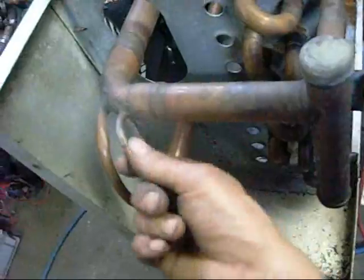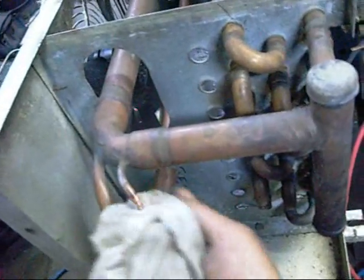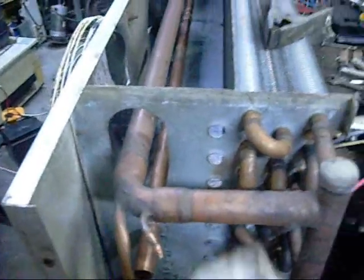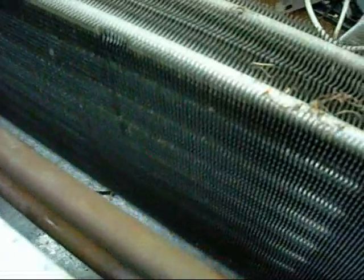That's already absorbed most of the humidity around here. The thing about this flux is it's boric acid flux - as soon as it absorbs humidity it turns to water, like a liquid boric acid solution, and it always goes green and frosty. So I'll try and clean as much up as I can. I've still got to wash this thing down with coil cleaner and take the fans off and wash everything again. It's a messy solder joint but it works.